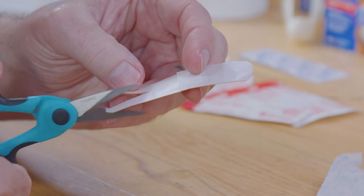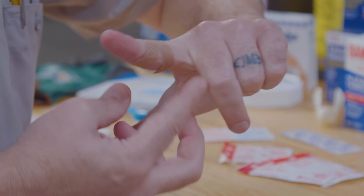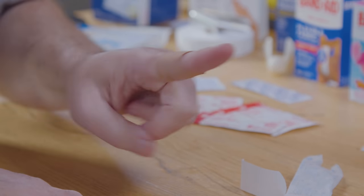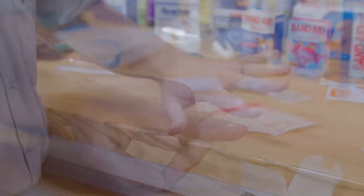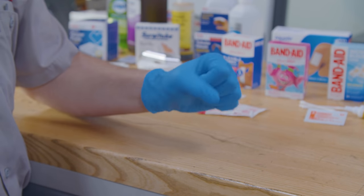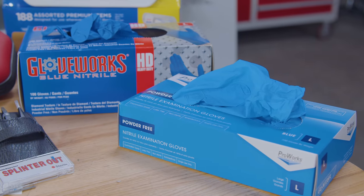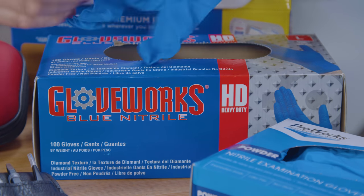These are perfect for a machinist who still has work to do. And if you don't have any knuckle bandages around, just grab some regular strip band-aids. We can cut right down the middle of each end so it'll straddle the joint but still allow us to bend those fingers. To protect this kind of bandage from grime and coolant, we can wrap the entire hand in a rubber glove. Nitrile or latex gloves are just perfect for this, and mechanics gloves work well when handling material in and out of the machine.